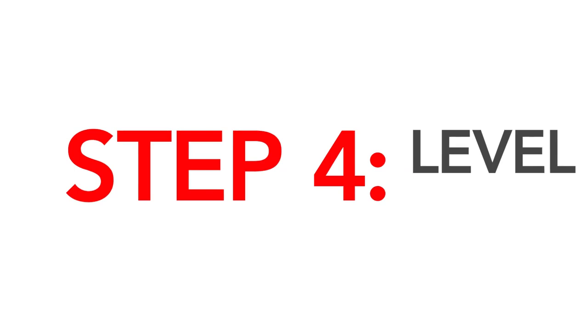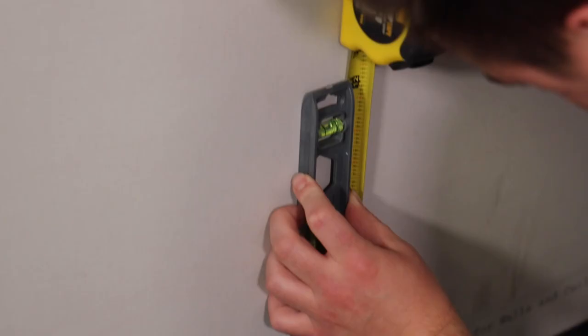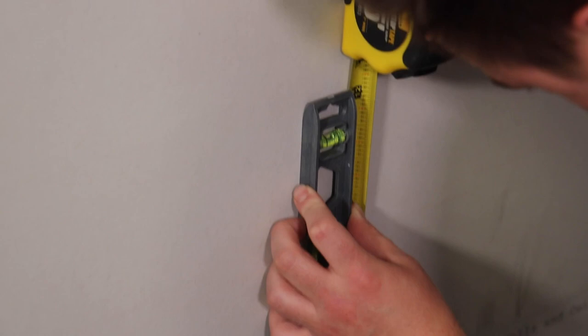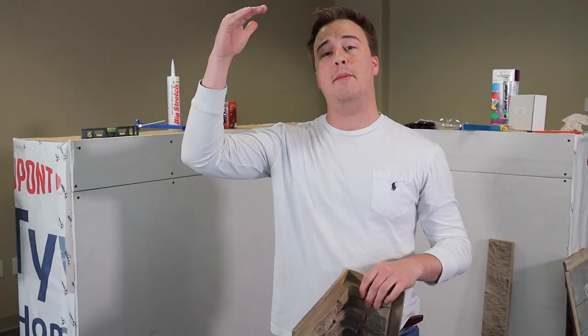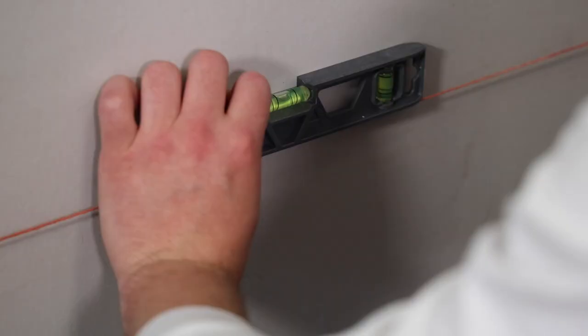That helps you delineate what looks good together and what doesn't. For example, a four next to a four — they'll be painted differently but from the same mold — so you might want to switch it up, put a one with a three. Really sit down with the project, plan it out, and decide what looks nice. Also keep in mind you want to level with your project area rather than with the floor, which helps avoid seams by the time you're at the top of your project.